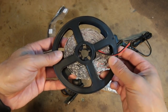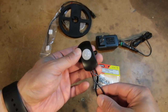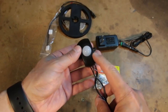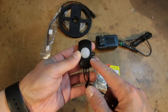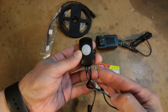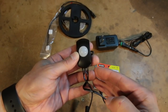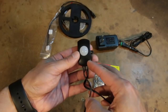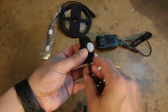This motion sensor is a perfect example of why you need to carefully read Amazon reviews, even when they're bad reviews. There are a bunch of one-star reviews from people who don't know how to use this, because it comes set from the factory with a three-second activation timer — meaning that once it sees movement, it keeps the lights on for about three seconds and then shuts itself off. That's really inconvenient. It also doesn't come with any instructions, but by reading the Amazon reviews, I learned how to properly use it, and then it quickly becomes a five-star piece of equipment.